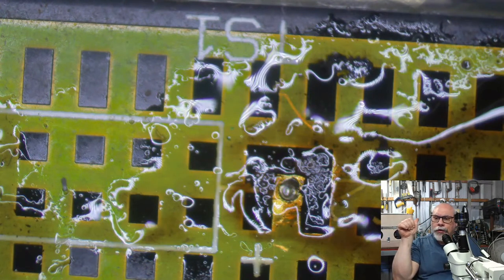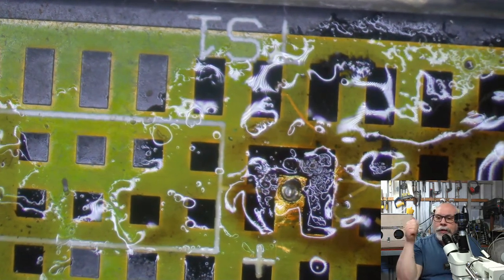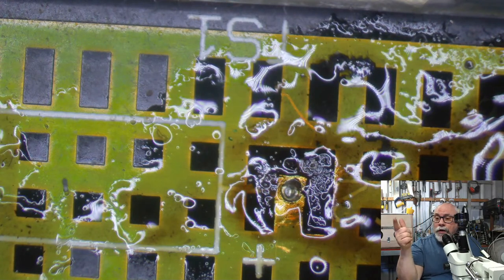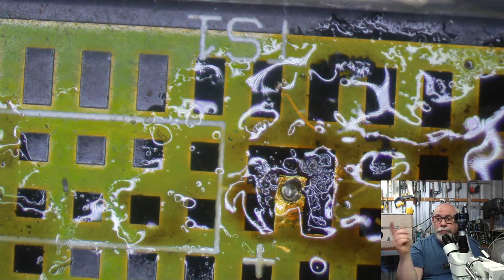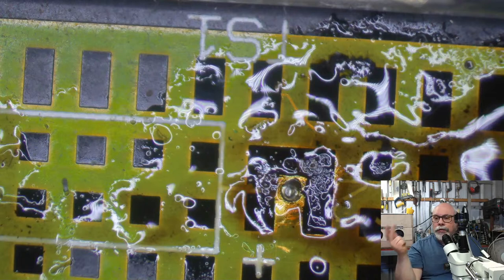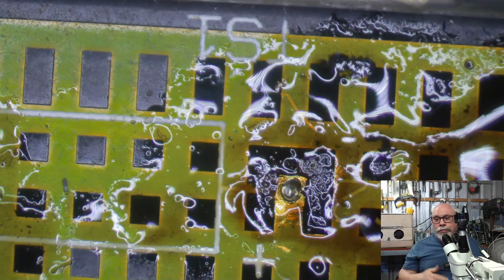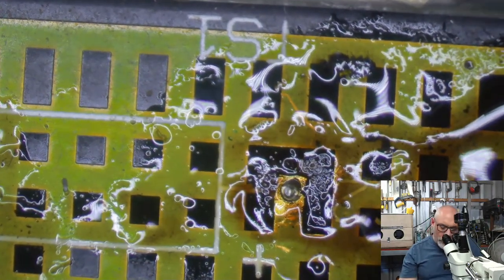we've got the eMac, which of course, as I say, they have problems now. A lot of those eMacs have problems now, flickery screens and stuff like that. There is the G5, well, that was the liquid cooled one, I think. So that was the 2005. And of course, they have leakage from the liquid cooling system. There's the Macintosh TV. Well, they got horrendous capacitor leakage on the tuner card and the logic board. And then you've got the MacBook Pro 2011 with, of course, the crappy GPUs.